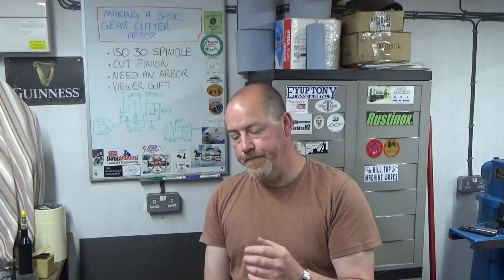Hello guys, welcome back to John's Workshop, and in this video we're going to be making a simple arbor to hold some gear cutters. The history behind that is, for those of you following along with my mill head restoration, where I'm trying to get an ISO 30 spindle to fit in the milling machine, you'll have seen that I had some difficulties getting my existing pinion to mesh with the rack on the ISO 30 spindle.